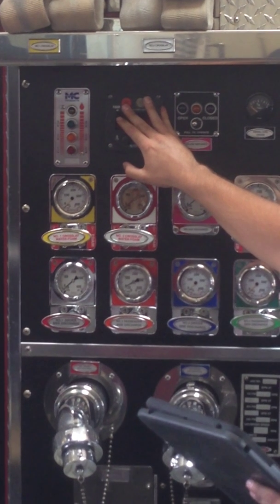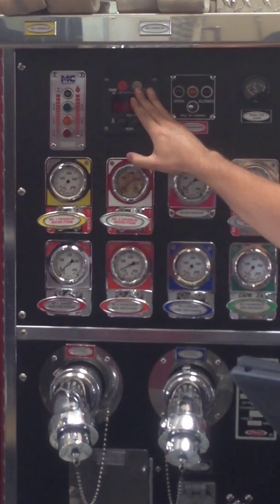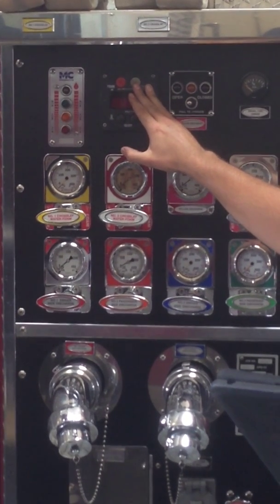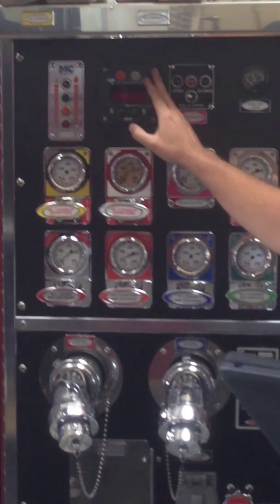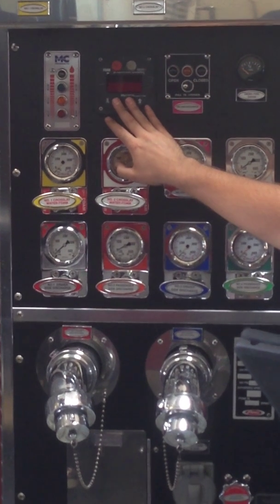The Foam Pro has 4 functions that can be navigated through using the gray select button. These are water flow, total water, percent mode, and total foam. To change the percentage, go to percent mode and push up or down to override the default setting. To change the percentage from any other mode, hold the up or down button for 2 seconds and the percentage will change.